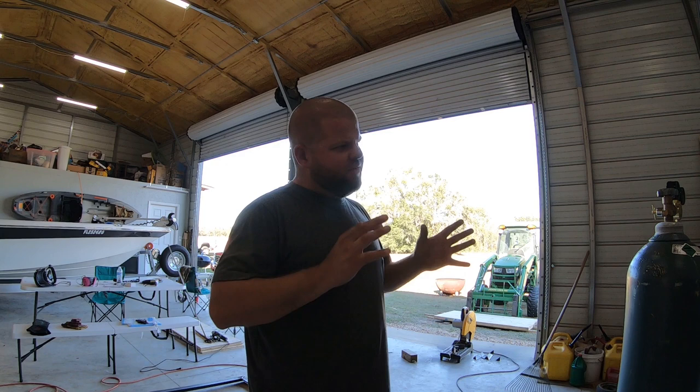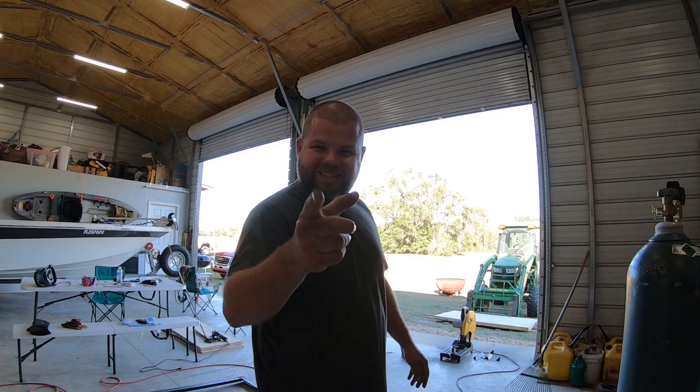Finally today, it was kind of fighting me again. I said, let me check that polarity one more time, even though I know I've already checked it. Exact opposite. So, thought I'd share that with you. Check that if you wind up getting a MIG welder.